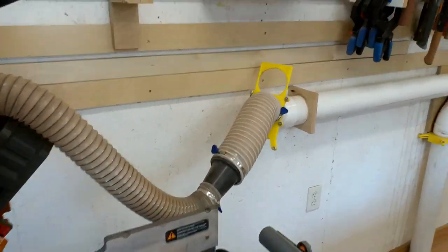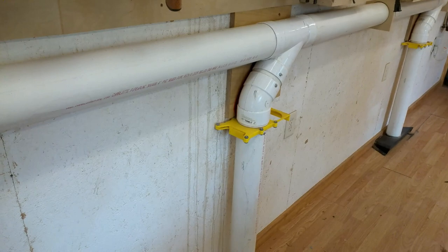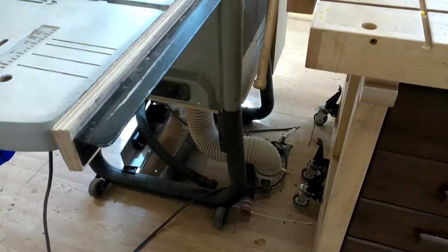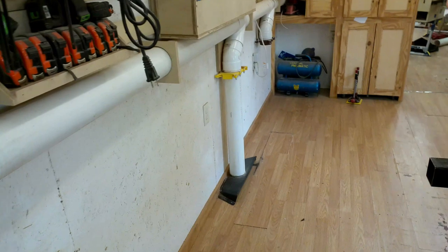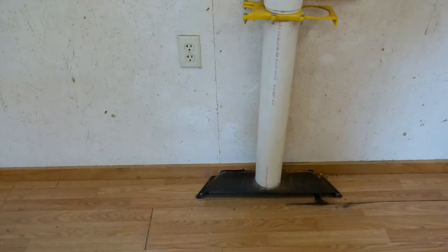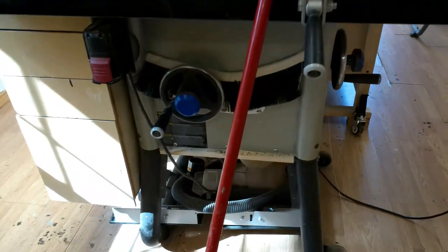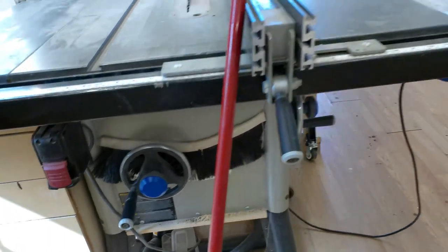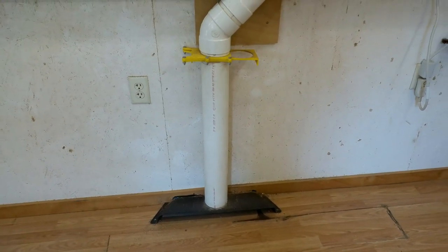Now that we have all of our drops hooked up, I've got this one over here for my miter saw. Luckily I've got a crawl space, so what I've done is run it through my floor, then underneath and back up underneath my table saw — that way I don't have to worry about tripping over it or going overhead. Now when you hook up one of these central dust collection systems, it should basically be against the law not to put in a floor sweep, because you are still going to get a little bit of dust — like right here on the table saw. I even have the little cloth thing but you can still see the dust down there. With the floor sweep though, you can just sweep it up within a couple of seconds and you're done.